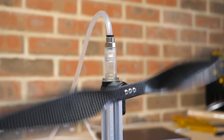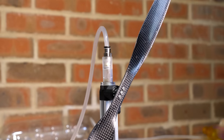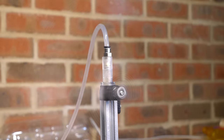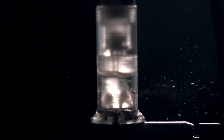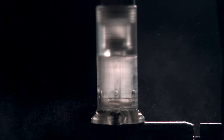Yet. The piston seal expands as expected, but just a little too much, to the point where it almost turns inside out. Whilst working on a slightly thicker design, I decided to test the engine again the next day, and well, it fired up perfectly. I think the cause for this was the rubber takes a few days to fully cure, so it hadn't fully hardened when I ran the first test. It's still not perfect, as it very nearly turns inside out, but it's just enough to hold on and keep an airtight seal. So how will it perform on the thrust test stand?